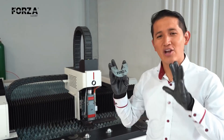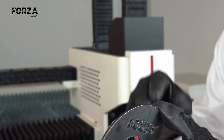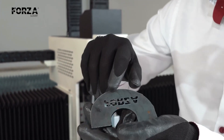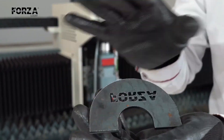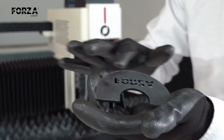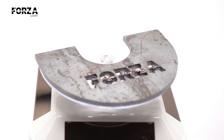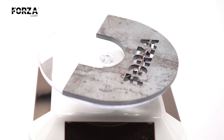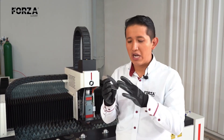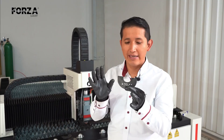And this is the result of the 3 millimeter cut. I dared to add the detail because I saw it was going pretty well. When we work with 3 millimeters, we do get a small edge that you can really notice, especially when you look closely — you can feel it with your finger. It's not a burr that can't be worked with. When you compare this type of cut to working with plasma or oxy-fuel cutting, this result is preferred. However, with 3 millimeters, we can't get a 100% perfect cut anymore — there's a minimal burr. I'd say the cut quality is at about 95%.